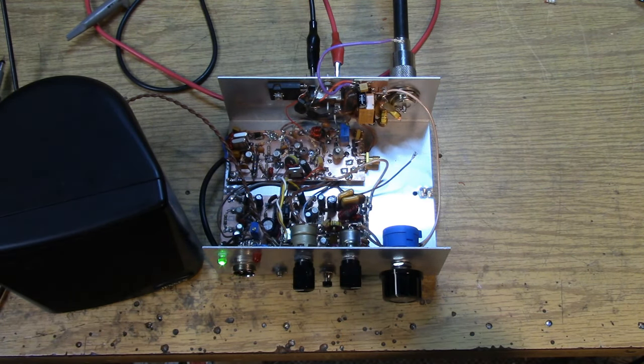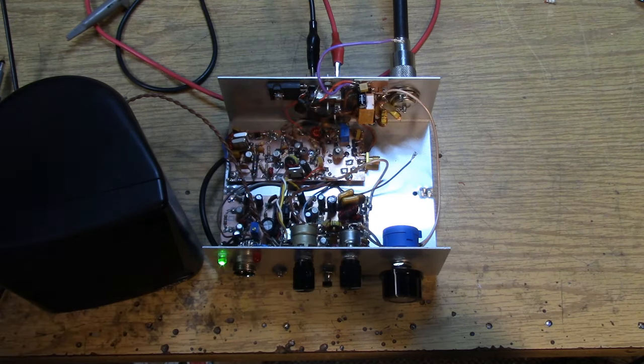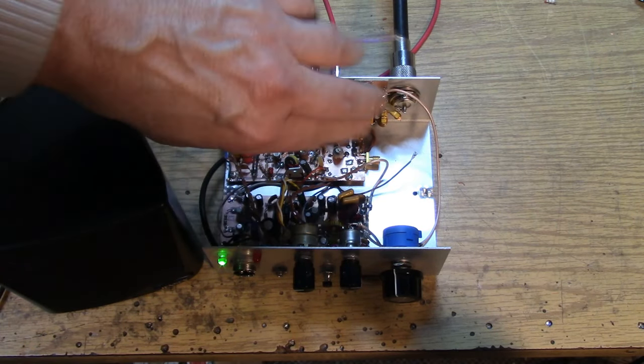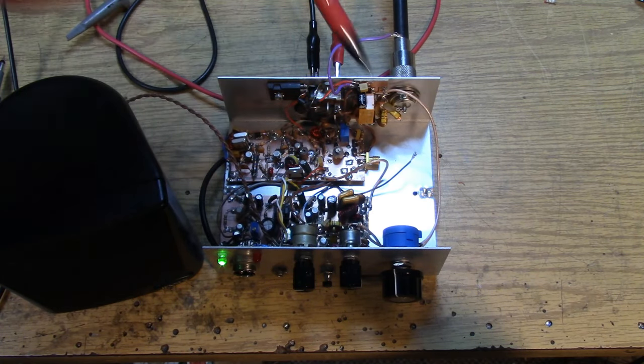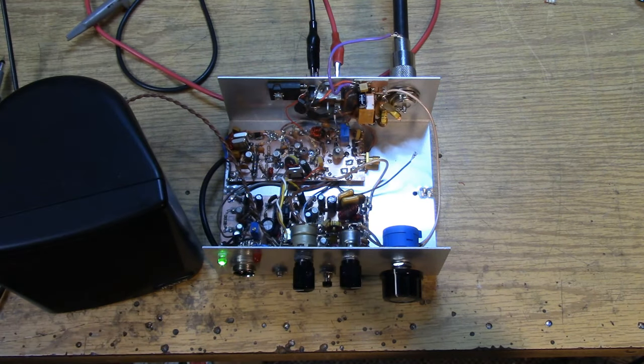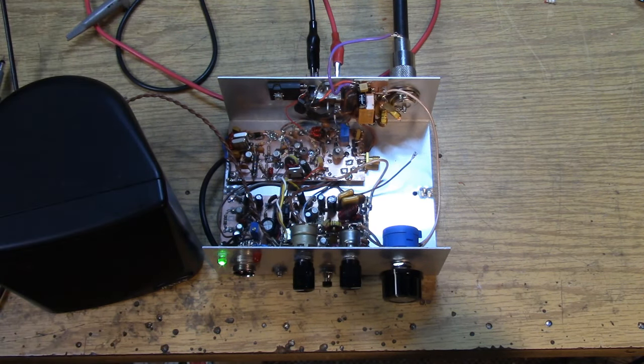Now, this is miniature. I definitely am pushing the envelope with miniaturization. And this shows that having separate little boards makes it easier to package. I think you all agree that being able to put the switchboard near the connector, having the separate VXO and separate receiver boards, gives me more flexibility with the power amp over here. If that was all on one board, I would like to have a system where I could score all of those and snap them off so that I could repackage it any way I want, or I could just leave it as one board and put it in a thin, wider type case. I'd like the best of both worlds: separate little boards or one big circuit board.